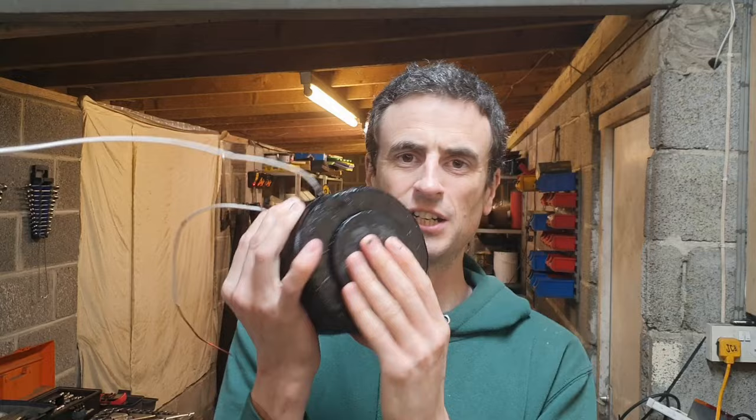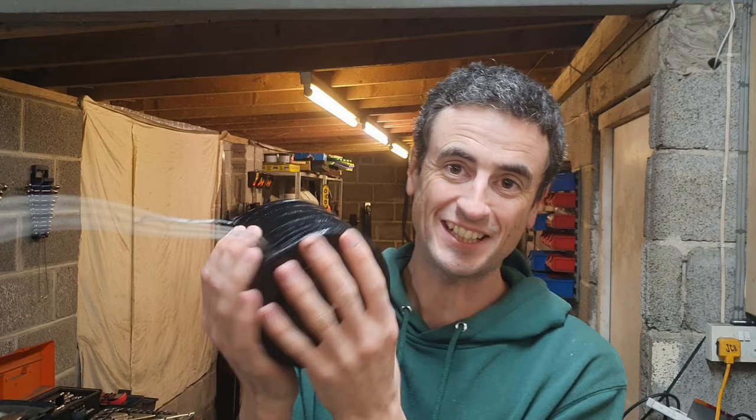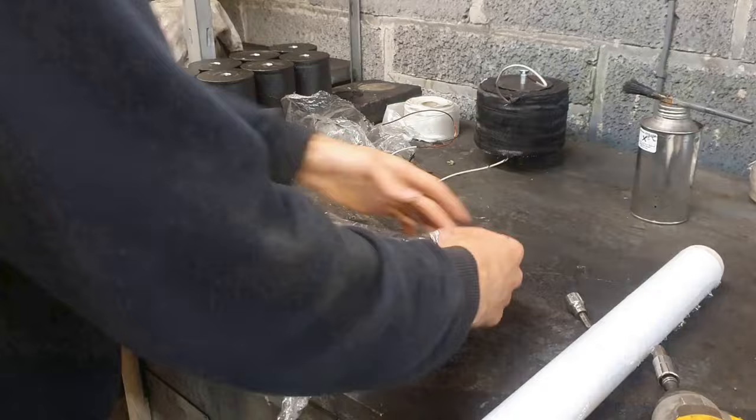I'm going to show you how I made this copper coil with iron core, why I chose the materials, and how I wound 800 turns of copper inside this insulating material. I've not done anything like this before, it's very exciting, it's a bit out of my comfort zone. But after this I can start to put the rolling road back together and work towards that day when I get my car on it and start testing it. So this is the process of winding the coils.